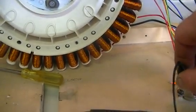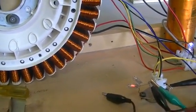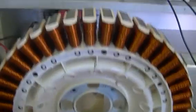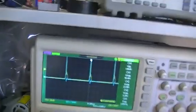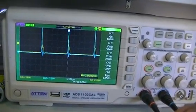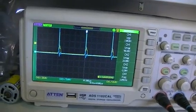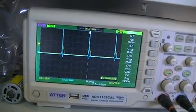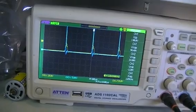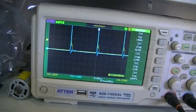What I'll do now is take my blue channel scope off and put it on the core — 22.8 volts. As you can see there's only a slight offset to one side of zero volts of that AC voltage across the core, but it is enough to light both of those LEDs.